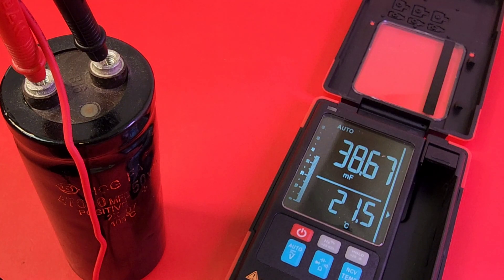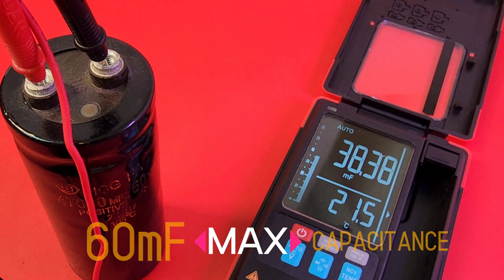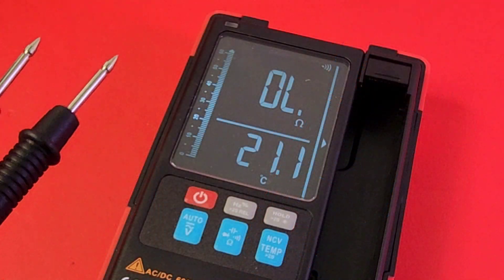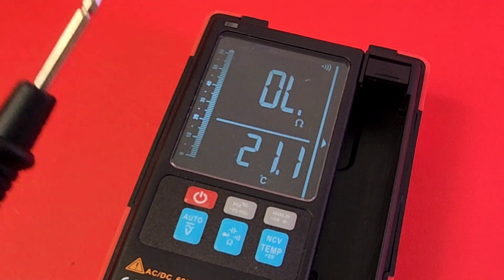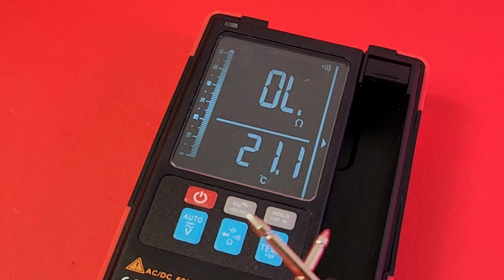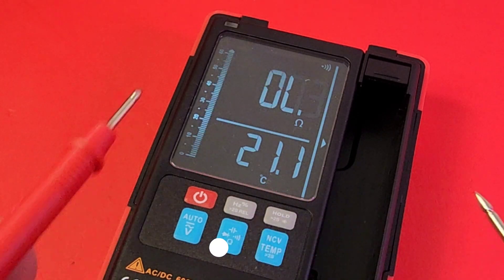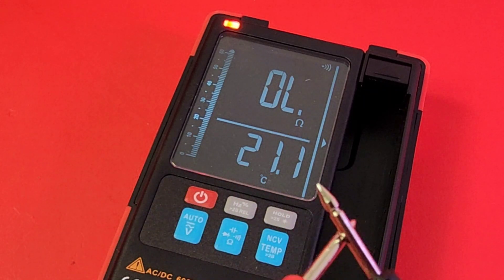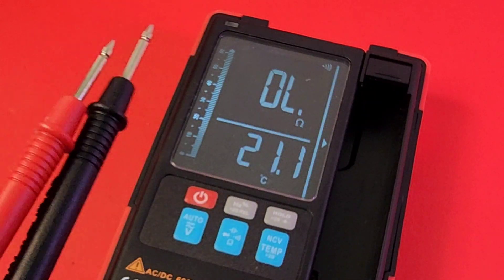A bit of a downer in terms of capacitance. Right now hooked up to a 47 millifarad capacitor — 47,000 microfarads — and it took about four minutes before it even got close, reading about 38 millifarad, which is still off for this cap. Disappointing — if you're into big capacitance testing, you might want to pass this one by. Normally when a meter has captive test leads, continuity doesn't always work out so good. Let's see: it's latched, we have a nice visual, but being a smart meter there's definitely a delay. Still serviceable.